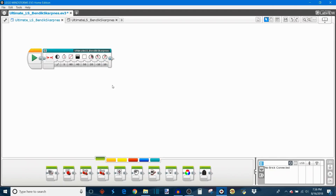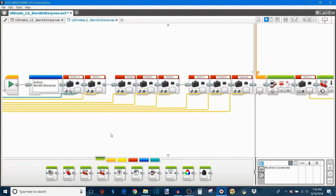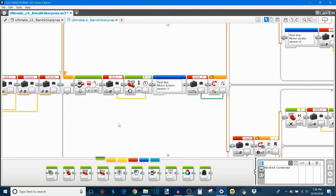Anyway, that's enough about the My Block — let's jump into the programming inside it. I'll click on this tab to expand it. You can see all of the parameters from the My Block are being read here and initially stored in variables for later use. Then we enter a loop. The first stage is the Coarse Adjustment Stage, where the robot is first approaching the line and starts making coarse adjustments to get close to square. The brick LEDs light up red during this stage, which helps with debugging so you know which stage the robot is in.